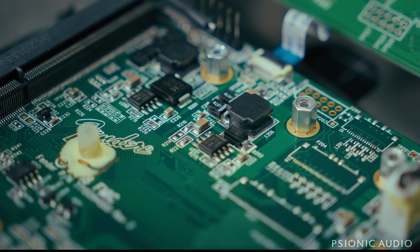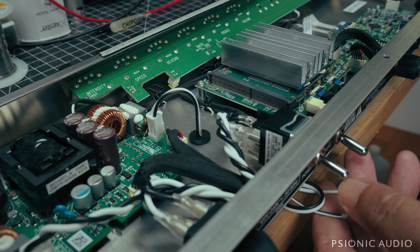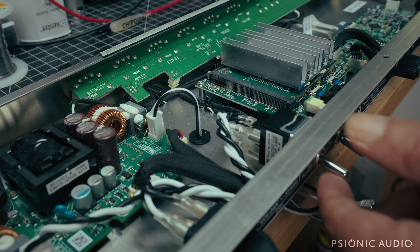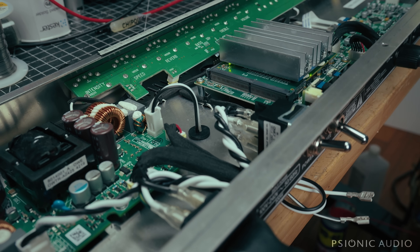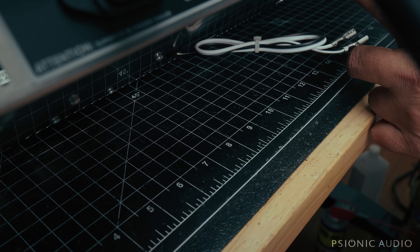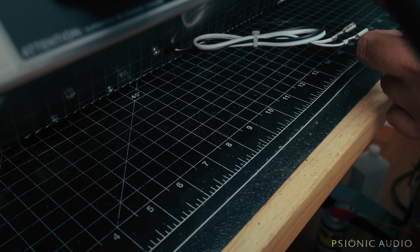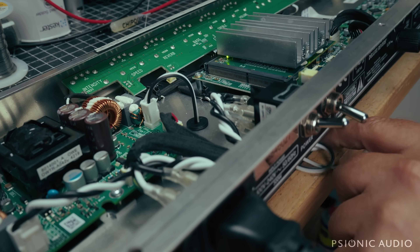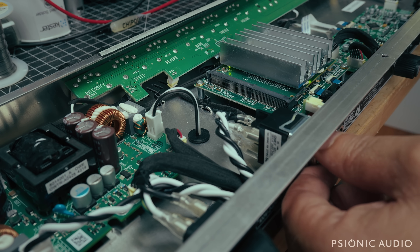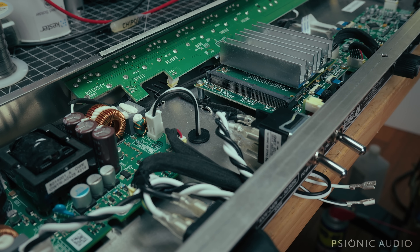I'm going to put the CPU back in place and see where we're at. I've got the speaker disconnected and it's cabinet sim on — should work fine without the speaker connected, solid state. I've got to go into my current limiter just in case. The little light that was flashing saying it needed its firmware updated is no longer flashing — which was the symptom I had. The front LED is stabilized at orange, which probably means something to those who have one of these. It's no longer flashing between red and orange, red and green. That's where that colorblind thing really comes in handy.